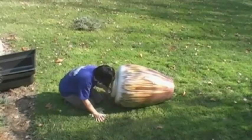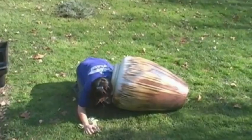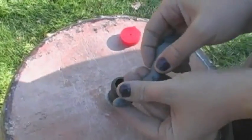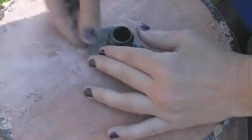Next, thread the PVC female adapter onto the end of the barb inside the pot. This is a little tricky, and you might have to crawl inside depending on how big it is. Finally, put plumber's epoxy around the base of the fitting to seal it in place and make the container watertight.